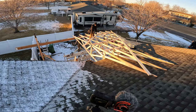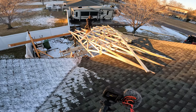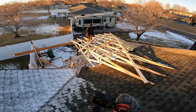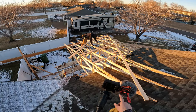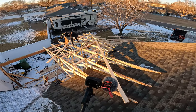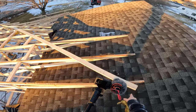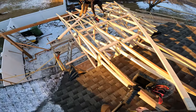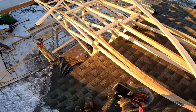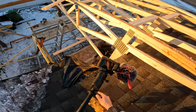These trusses carry 954 pounds each on that ledger because of our snow load in our area. So again, everything — there's no load on this roof other than just tying it in. It'll be carrying a little bit of the sheathing and the shingles. It all comes down this cord and transfers down into our ledger on the house.